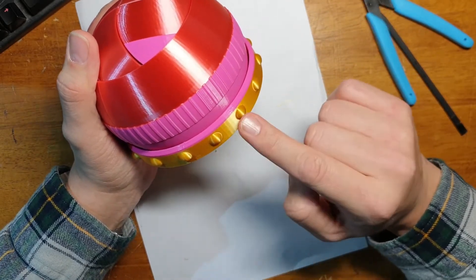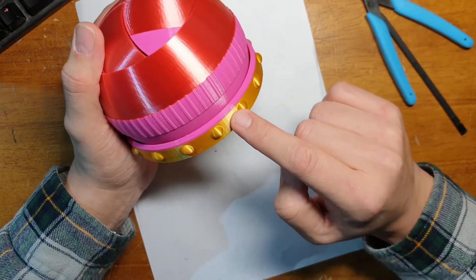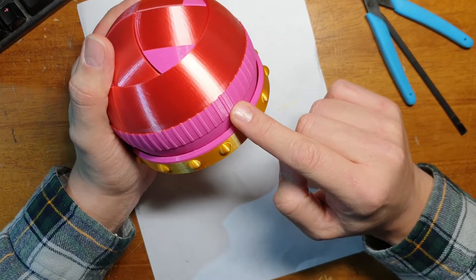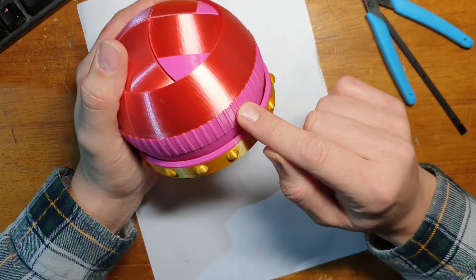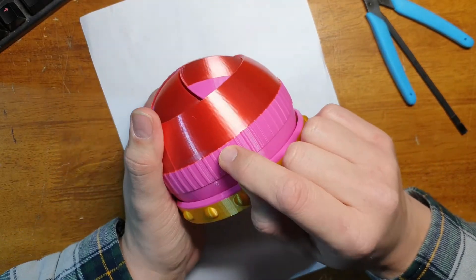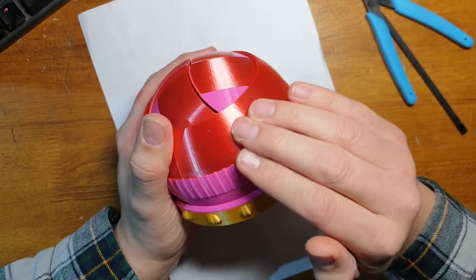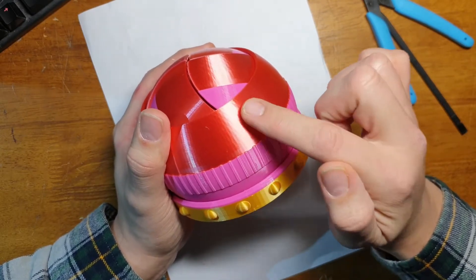Once you take the filament change, you can also change the temperature. I print the bottom section at 210°C because that's silk PLA — it prints better at 210. I printed the next section at 190 or 200. I forgot to change the temperature back when I went onto the red, and you can see this band just above the pink — it's actually a different colour to the rest of it because at that point I spotted the error and changed it manually. Look how much shinier the silk PLA is at the higher temperature: that section was at 200, this one was at 215.